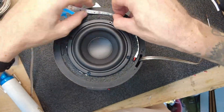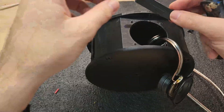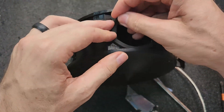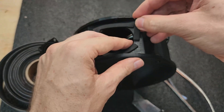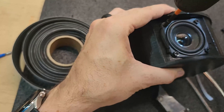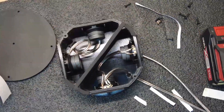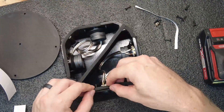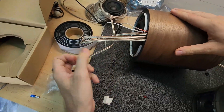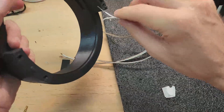For the LED strip, originally I planned to have it flat around that groove but I realised it couldn't bend in that direction, so I had to turn it sideways and fit it around against the little lip. For fitting the 2-inch drivers, I used some self-adhesive foam strips around the outside to give them a nice seal. Some people use threaded inserts that fit into place using a soldering iron, but I find it easier to just 3D print the holes at the right size and then the screws just create their own threads in the plastic. The top lid over the driver enclosure also uses foam tape all the way around. There are two separate enclosures for the left and right channels. The slot I made big enough so I could run all of my wires down from the 2-inch drivers and the LED light strip, through the leg and into where the amplifier is housed.